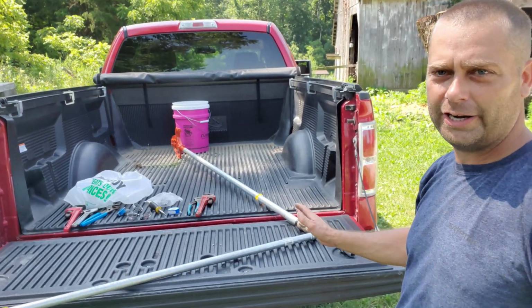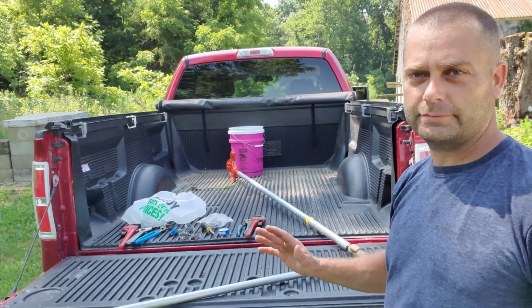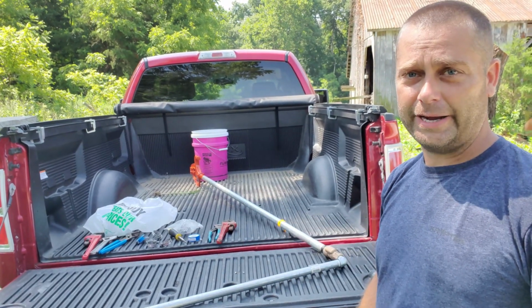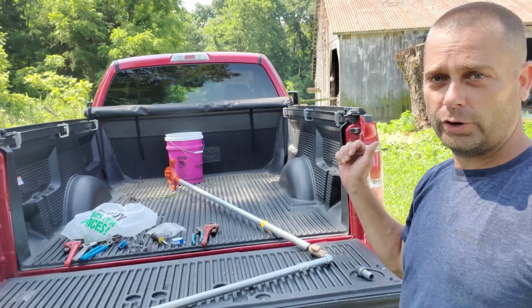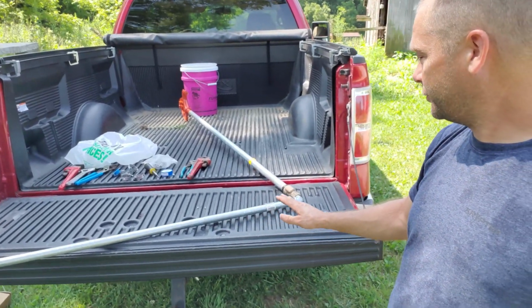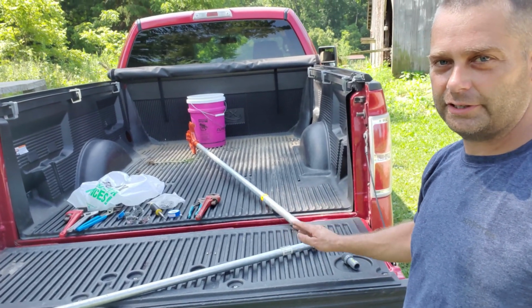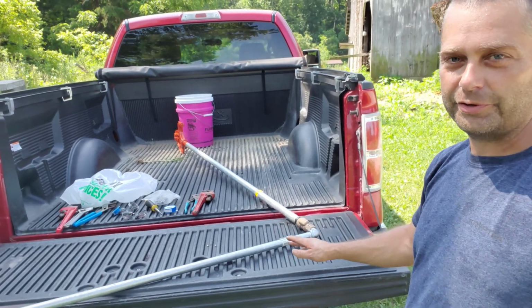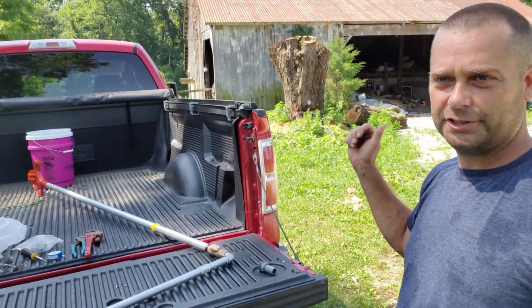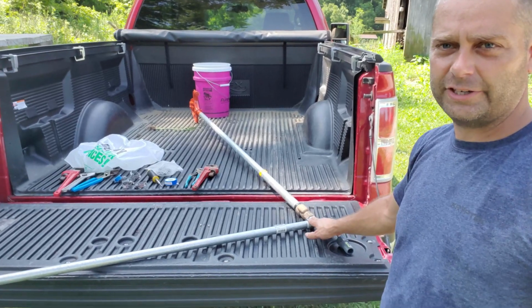So I've got my water hydrant. It's completely assembled. What we're going to be using is just some black rolled pipe, basically rolled up plastic piping. It'll be 1-inch piping from the water valve out to the hydrant. Let me explain why I put this together the way it is. I used galvanized pipe here just because it's going to the livestock and barn. I think galvanized pipe will be fine. All my fittings going toward the house, I decided to use brass on my original install, so everything heading toward the house is all brass. But we're just going to use galvanized pipe today.